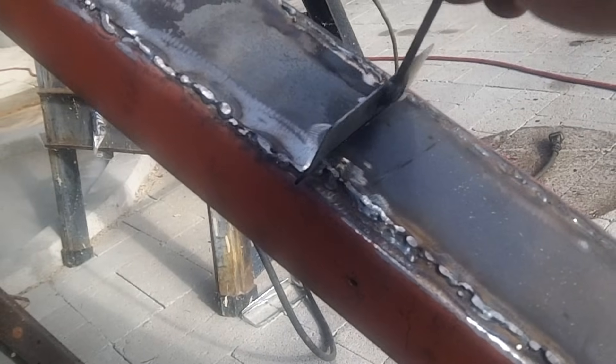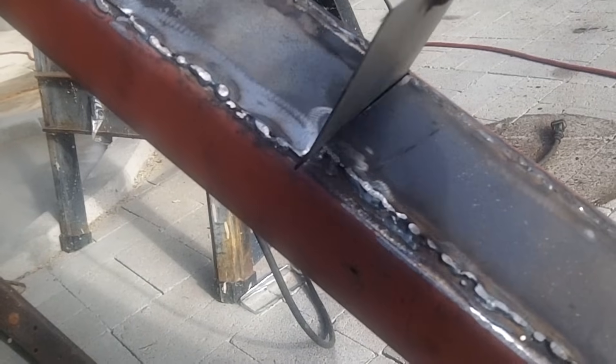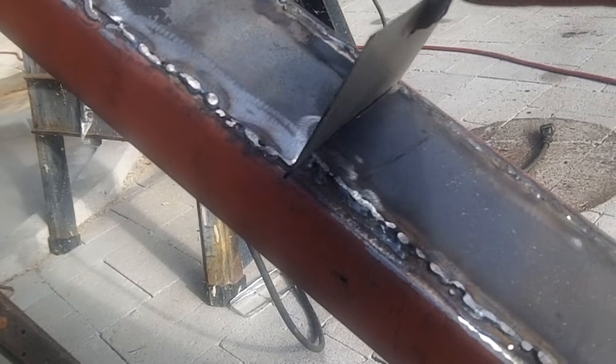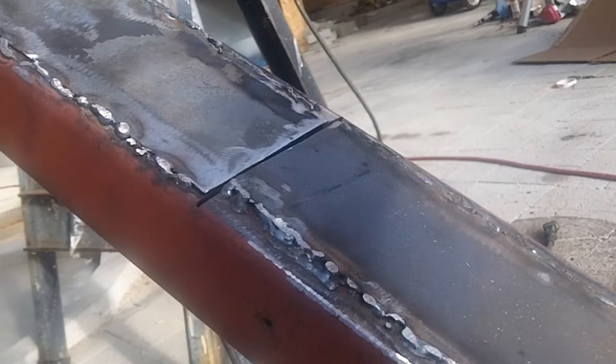Next, I added a gate partway up the feed tube. Originally I was going to make it so the feed control gate could close and let the fire go out, but the pellets would continue to gasify behind the gate. Adding this gate further away would allow the pellets to burn out and leave enough space between the fire and the gate.